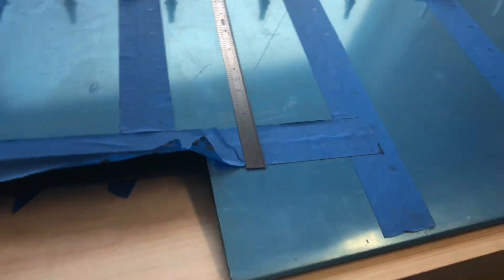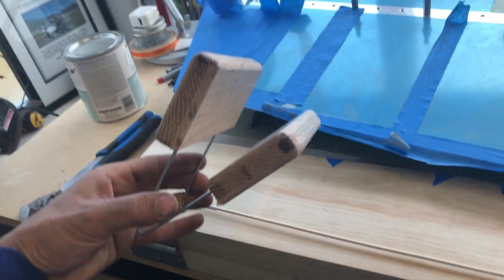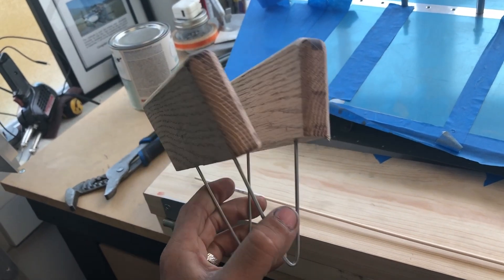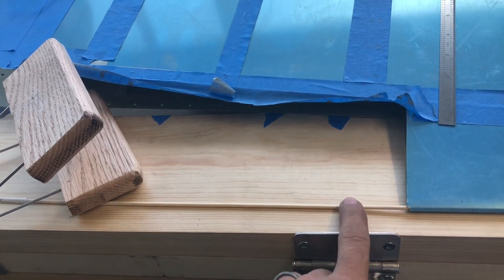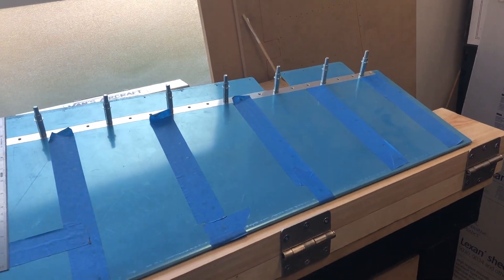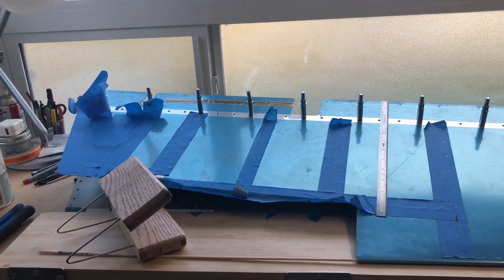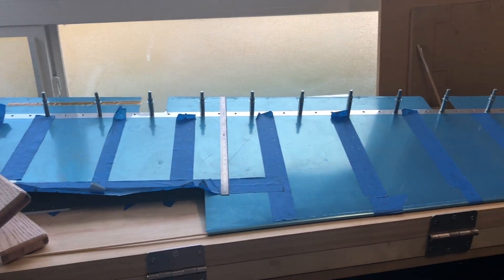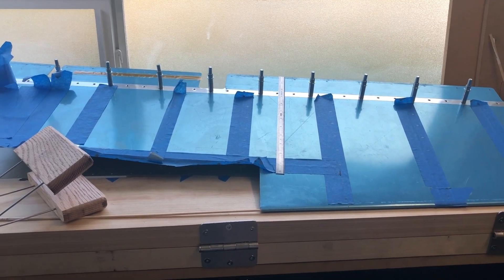I'm going to leave this video off here. This was a great tool — definitely go ahead and make one of these. It was cheap, it took me 20 minutes to make. Rounded the edges with my router a little bit. Some oak that I had kicking around, some 3/32" 309 TIG wire. I'm probably just going to pull this out and get some 3/32" in there. I'll bring you guys back for the next video where I'm pretty sure all this bending will be done. We're going to get assembling the spar skeleton, get this thing rolling in video 3. Might be a 4th video to sealing up this elevator — we'll see how the 3rd one goes.